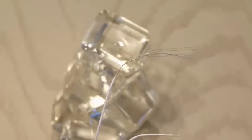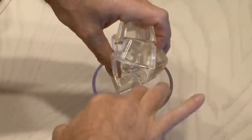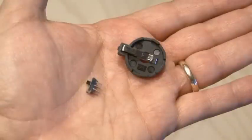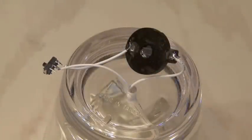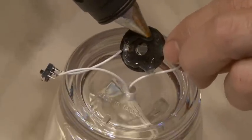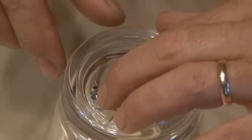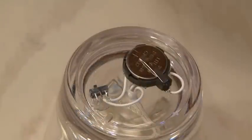Using some wire, we'll connect our negative and positive leads and run those wires through the hole in the bottom of the cup. This entire thing will be powered with one 3-volt battery, so we're going to use a standard 3-volt battery holder and a little switch. Two wires to the switch, two wires to the battery holder, and then some hot glue to hold the battery holder in place and a little dab for the switch. Everything should fit pretty well in the concave cutout in the bottom of the cup.